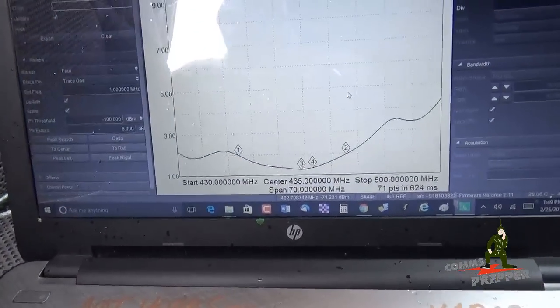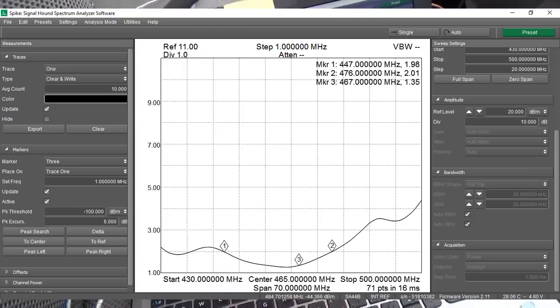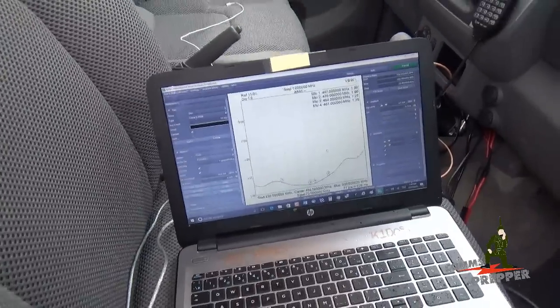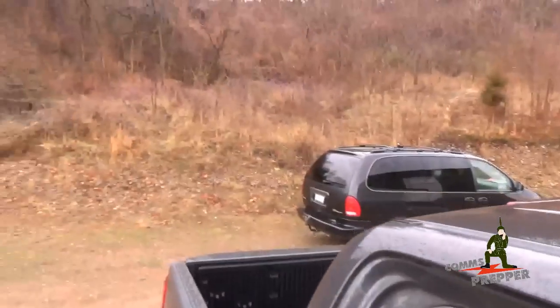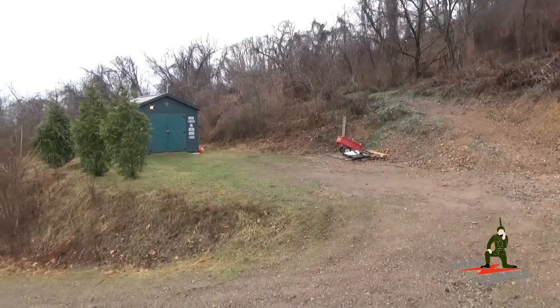So there's the plot — I'll insert that screenshot one more time so you can see it. Basically what we're doing is sending a signal down to the antenna and measuring the reflection coming back on the spectrum analyzer, giving us a plot of where the antenna is more resonant for frequencies. I'm very happy with this antenna and very impressed with the MXT-400 mobile radio. As always, thank you for watching and subscribing. This has been the Comms Prepper out at the Rainy Retreat location.